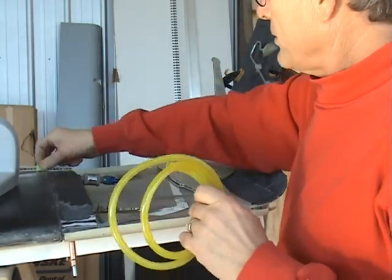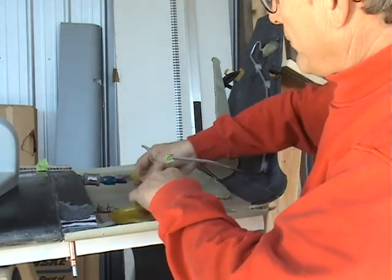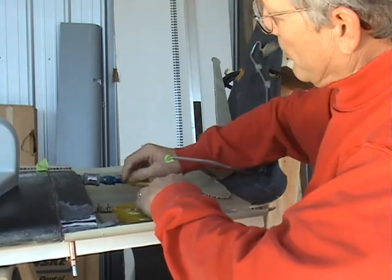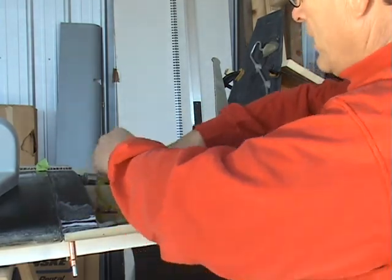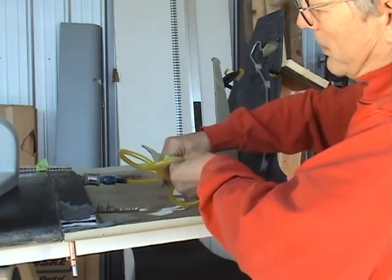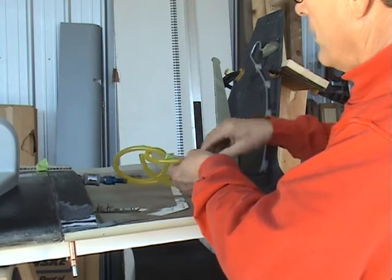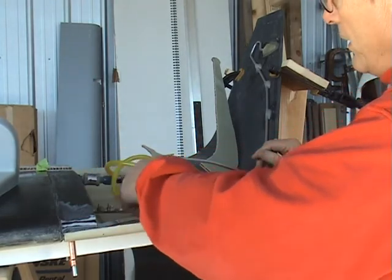Although here's another idea: you can use this part of this Stratoflex fitting and put the Tygon tubing on this. You can actually screw it up on it. Then use the aviation clamp on that, wrap this around and attach it to here with another aviation clamp. So they show using the Tygon tubing originally with the original plan, so I don't have a problem using that and having it used in this application.